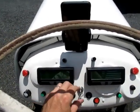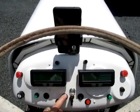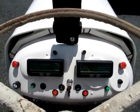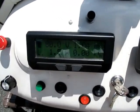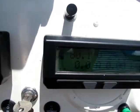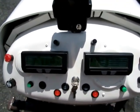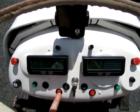First of all, turn on the main key which starts the 12-volt supply, then turn on the pre-charge switches for both PTO and engine - that also starts the displays, the CA3s. Hopefully you can read those and see what's happening here. At the moment we've got about 80 volts through the batteries - 72-volt supply.